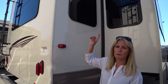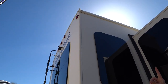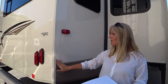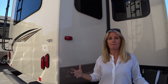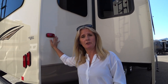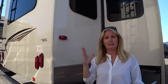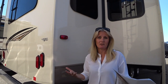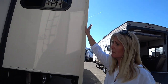The roof has a bit of a shape to help water shed, plus rain gutters to get water away from the trailer. Make sure you check all the caulking when you get your trailer, because if you can keep water out you're in good shape. The batting insulation in the walls is glued in place between the frames so there's no sagging — that's ultimately how you maintain your R value.